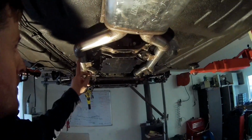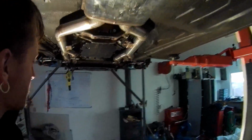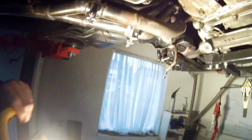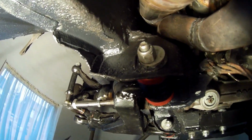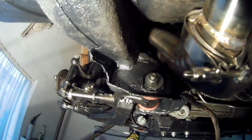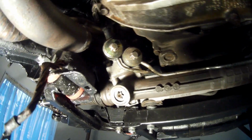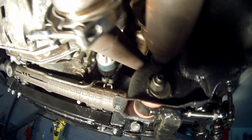I put a small pipe in between here, and this one I welded new in. So it's now fully connected without any tension on the pipe, so that's pretty good. So I got all the room in here. It's still about a centimeter, that's enough, because the engine is not really moving a lot. I have to do some insulation things to make sure that nothing is getting too warm. Also on this side, there's enough space in here.